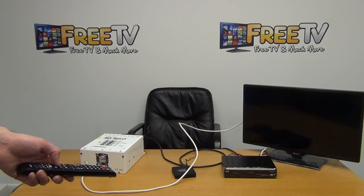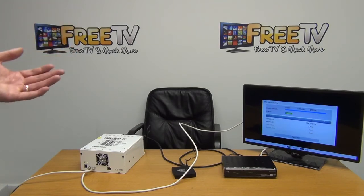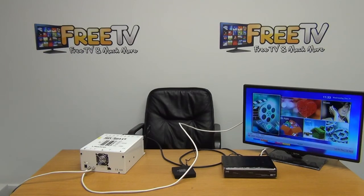You can see it was an extremely strong signal, and we can see the bandwidth — both channels, actually. If I go to the next channel in the sequence, it comes up on channel 36 as well. Because with muxes you can have six or eight channels per mux, the way it's set up here is two channels on the first frequency, then the next set on the next available channel up. So we set it up as two channels on 36, two on 37, two on 38, and two on 39. That spacing gives a really clean cut-off between signals and is working extremely well.